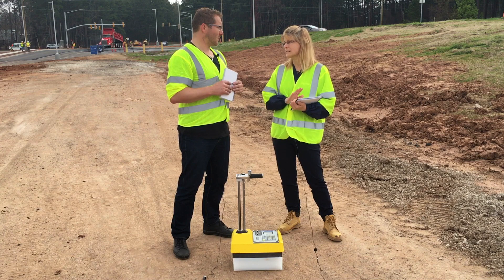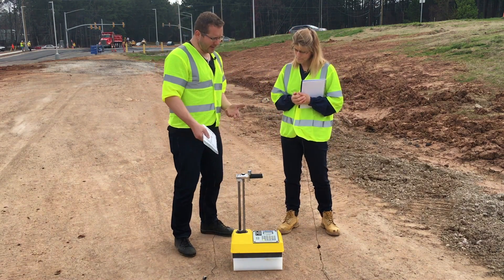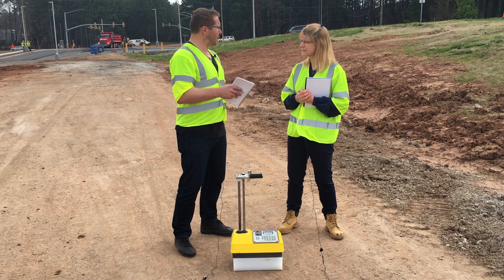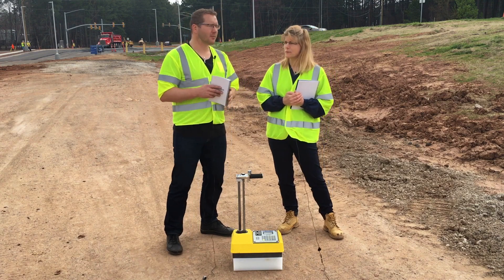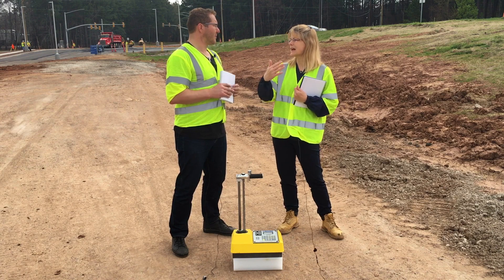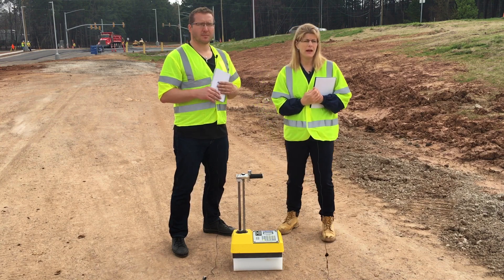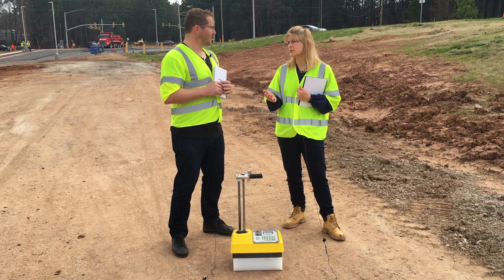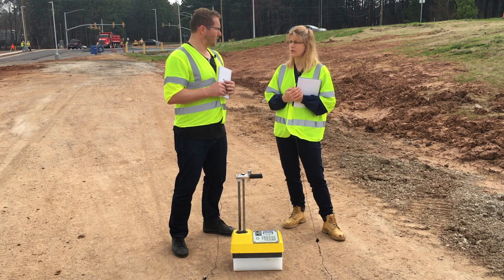So the calibration report is kind of the golden rule. Every day I take a measurement, I write it down in my log. Definitely. And if it's close it should be good, but if you want to make sure, check the calibration report. They shouldn't vary much from day to day, and the only way you're going to know that long term is to keep that standard count log book — so you can see last week's and last month's counts and make sure there are no big shifts or jumps in those counts. Remember, if you can't get a good standard count, you're not going to get good measurement counts in the field. Always be sure to have good standards that are comparable to the ones on your calibration report or consistent with those in your log book.